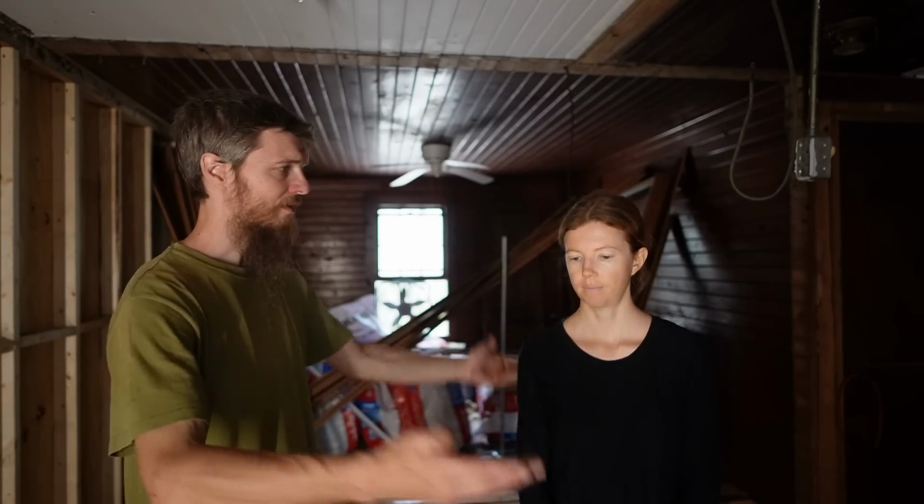The floor is fine. What we're going to do is nail down any loose boards. We're going to put some ring shank nails in it, secure it. And then we're gonna try to relay the wood floor on top of it. And when that's done, it's gonna be super solid. So I'm not worried about it. And then where do you end anyway? I mean, this is under the whole house, basically. Yeah. So it's gonna be fine for the kitchen.